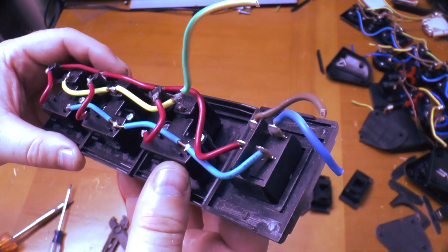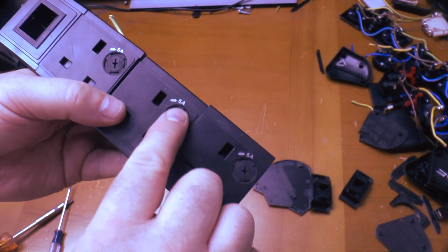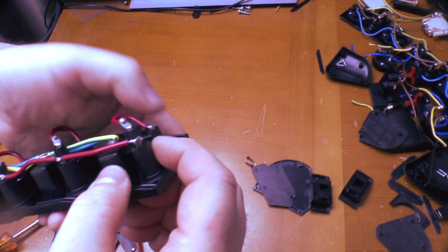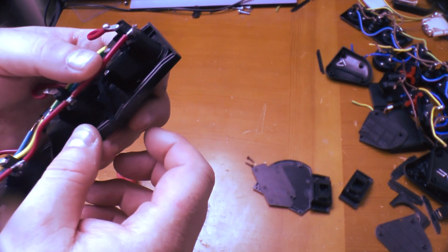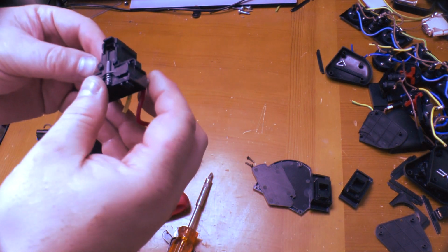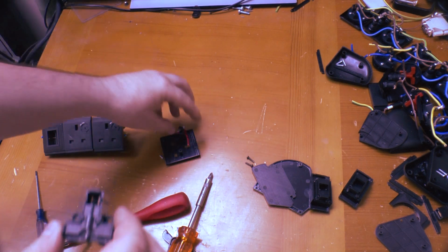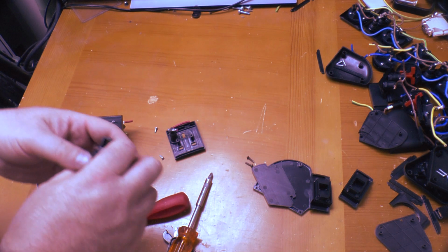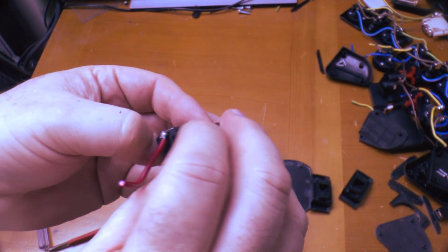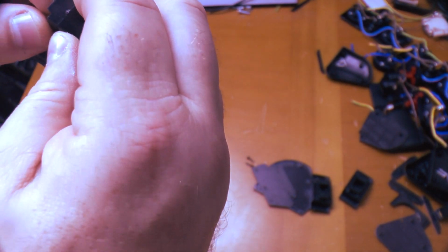So these sockets are a different type. These are MS589. There's no current rating on them unless you read on the front where it's actually stamped on. And they've got these standard push fit fuse holder modules snapped into the hole. It's an interesting little module. It's a complete recessed socket designed to go behind a plate like that. Would that fit with one of those other plates? No, it's not designed for those. But interesting little module, and it's actually clicked together in a few places. So might as well pop it open because this is not going back into service.